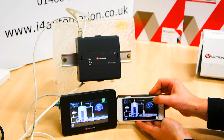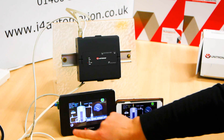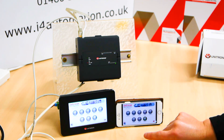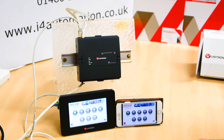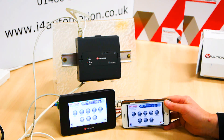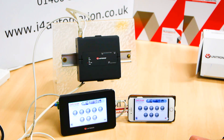We're connected to the TP-Link. Now using a VNC viewer, I've got a shortcut to one I've been using previously. So now what I've got is the same screen, same connection, and I can control the same process. At the moment the process is running automatically. I can stop the process, I can start the process. I can go back to the main screen and control the IO — turn the outputs on, turn the outputs off. You can have the display anywhere: a Wi-Fi connection with your smart device or laptop as you walk up to the machine to see what's going on. That's just a quick demonstration to show you the basics of the connectivity of the PLC with the virtual HMI. Thank you.